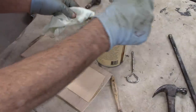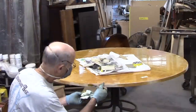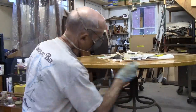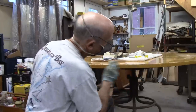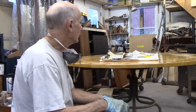The first stain I'm going to try is some light golden oak. The color's good — it's a little light, but I like light; I'd rather have light than too dark. I may try this on the table itself, and if it's light, that's okay — I'll seal it with shellac and then add a little more color to it. I've let the stain dry for a couple minutes and now I'll wipe it off. I'll kind of pat it off — remember, the stain was light so I don't want to wipe it off too much. This is fast-drying stain; I'll let it dry for an hour.